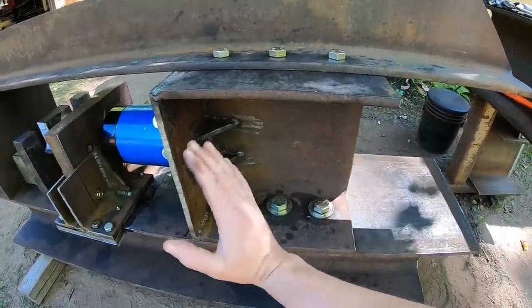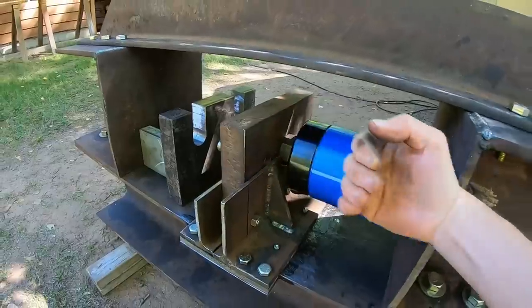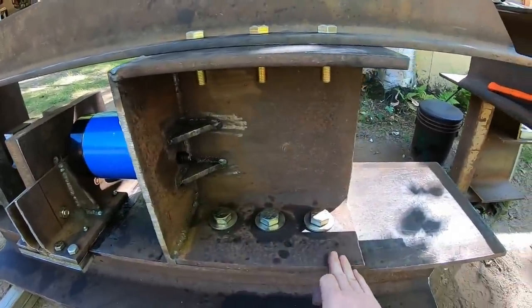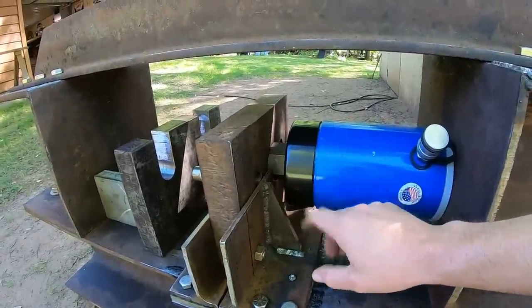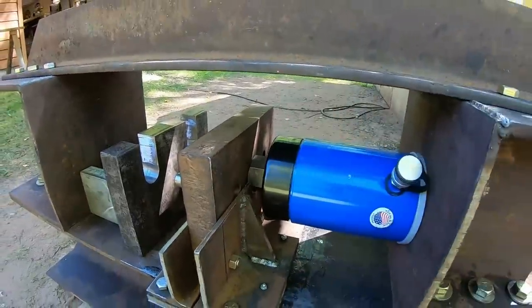That gives you more flexibility to move this back piece, even in case I need to redesign a new push point here that's going to give me more distance. That's not a big deal. Ram travel's only 3 inches, but 4 inch spacing worked best for the real estate that I had to occupy. And if I need to make up that last inch of discrepancy, I can make it up with my wearable push adapter on the end of the ram piston.